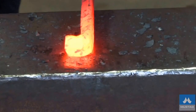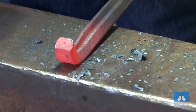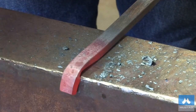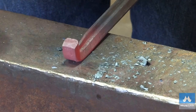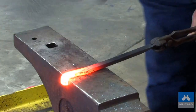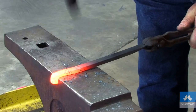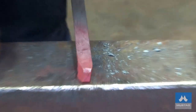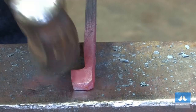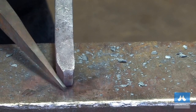What's important is not to drive it down too fast. If we drive it down on the top too fast, we're going to get cold shuts in it. What's important is to contain the distortion. So if we hit it on the top and the sides start to distort, we have to contain the distortion — normally not more than three hits on any side. Start to just thin it in front of the heel cork a little. When we look at it on the backside on the hoof surface, what I'm looking for is to create a heel check. It's not just hitting the heel cork — it's hitting right up to where you've got your heel check. The heel check continues right through the cork.